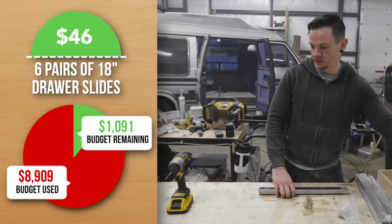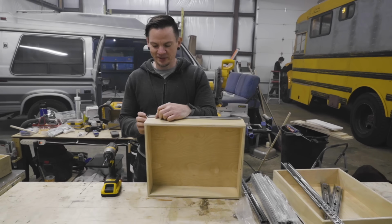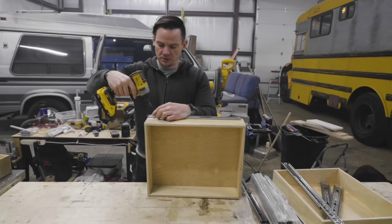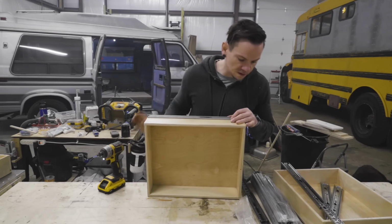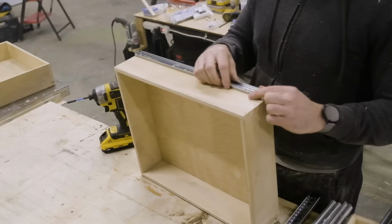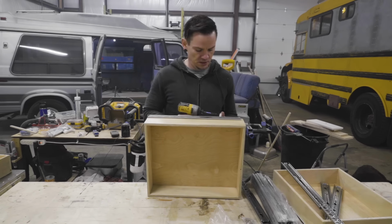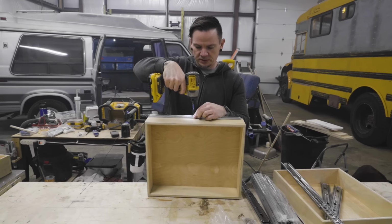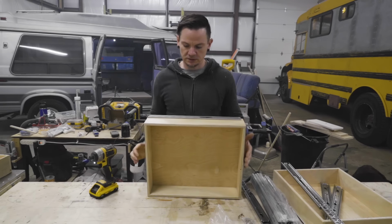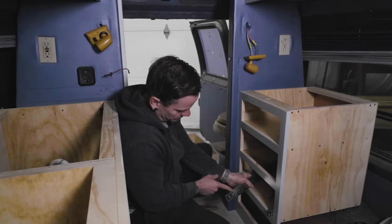We will show you the install pretty quick. Take the inner piece out. What I like to do is go with a horizontal slat on the front. That way you can adjust it forward and backward. And then on the back, is moving it up and down to be flush with the bottom of the drawer. So you go with the vertical slot. In the middle is the circular hole where it's already in place. So there it is. Now we will take the side brackets and put them in the drawer box itself.